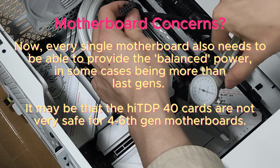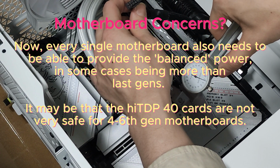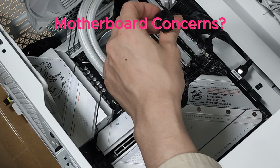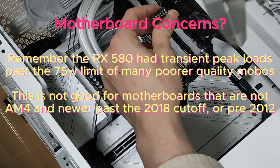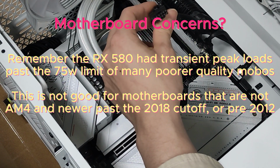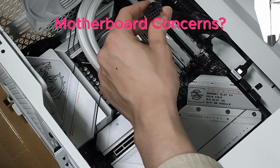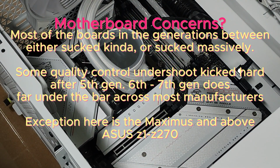And if the transient of the card itself is about 1000 watts maximum, the slot itself can only take about 120 to 150 watts. Now, if this connector can only take 600 watts, automatically you already have a power problem at 750 watts. Now, you transient even higher than that, you're overdrawing on the motherboard or the connector or both. So now you have a fire hazard not only with the motherboard, but also the connector itself. But most likely, by way of design, it's going to all draw through the connector itself and have power excursions, say, of upwards of whatever 1000 watts.